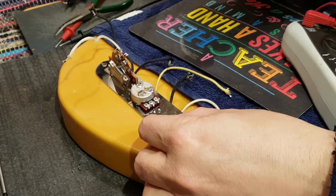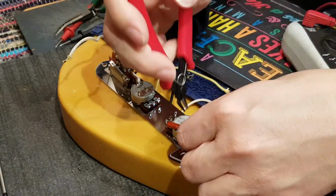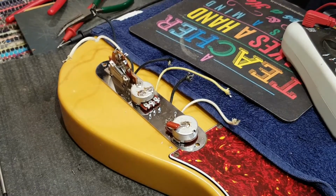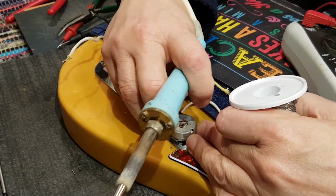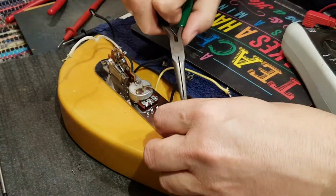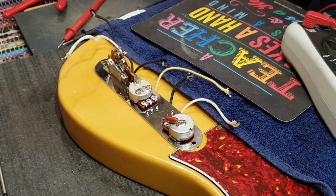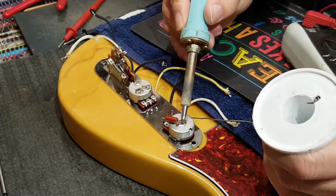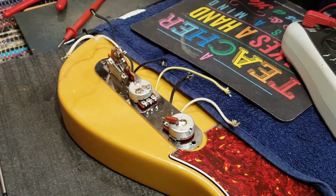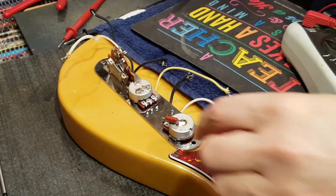A good solder joint should never take more than about 3 seconds. Otherwise you're overheating the job and the component. Alright, so I'm going to swing this a bit around because this thing needs to safely go back in the cavity. Now I can make it stand up a little, so I will do that. Just like that. And it's on. See, nice shiny joint. Right, good and solid.